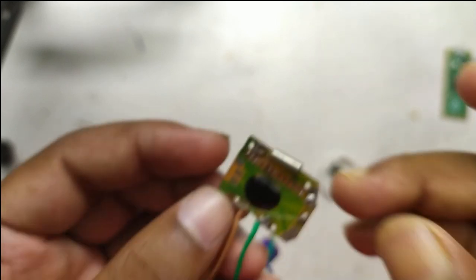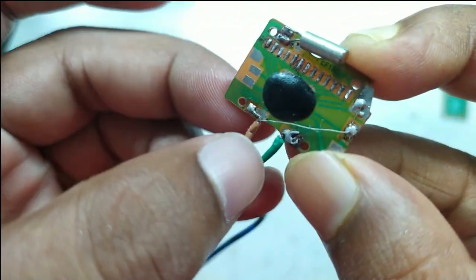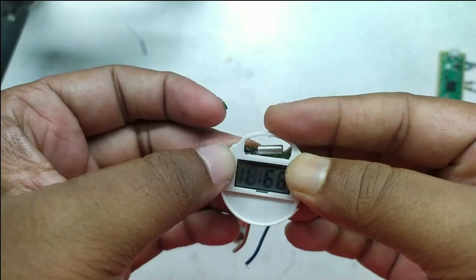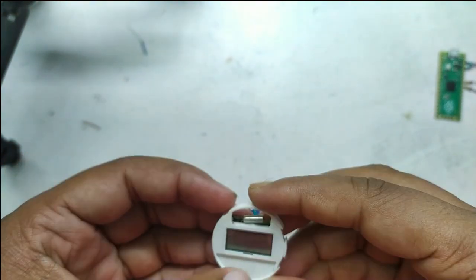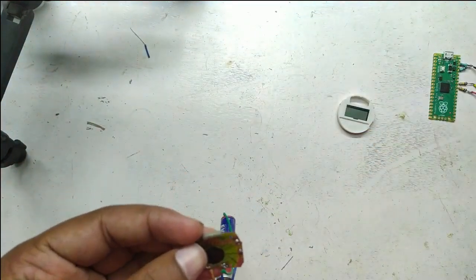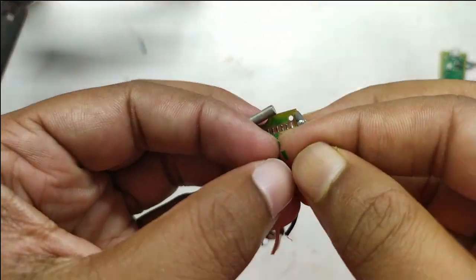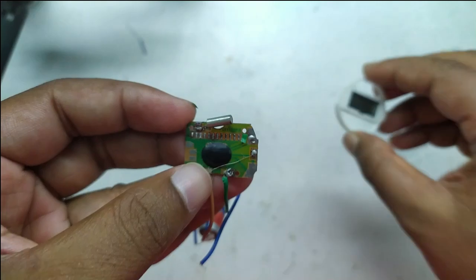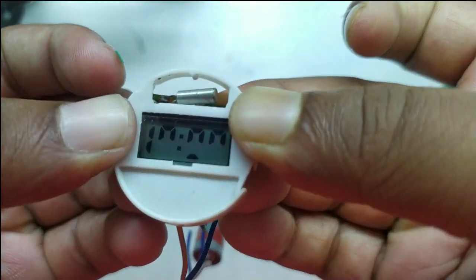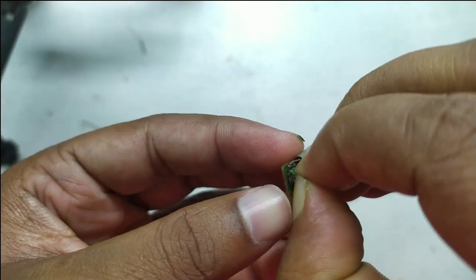So we have 24 segments in total but only 13 pins to drive them. What is the trick here? To find it out, I have jumpered both switches to VCC — now it shows all segments at once, that means 1888. So we will block the drive pins one by one and by observing the missing segments we can find out which pin drives which segment. Now I have blocked pin 13, the leftmost pin.